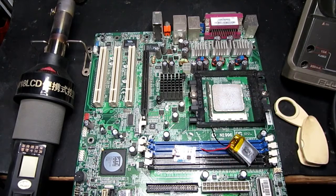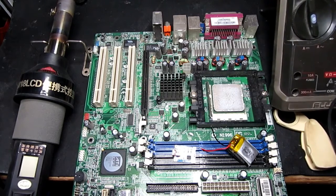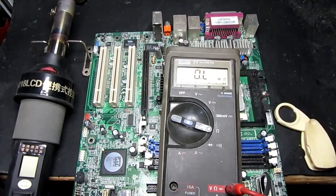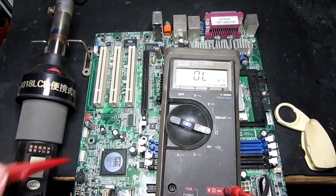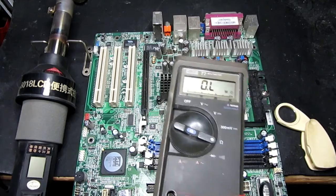I scout around — that's why this old motherboard is here. In this area by this crystal there are a couple of 10k ohm resistors. These days you cannot trust anything to be exactly as it's labeled, so just with the meter on this component we can see that it's 10k. These little SMDs are 5%, so we'll get that off that board and swap it onto the charger.